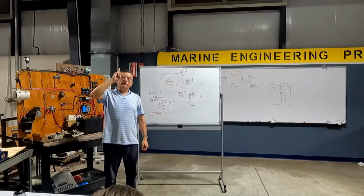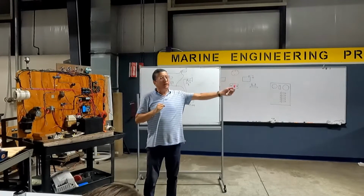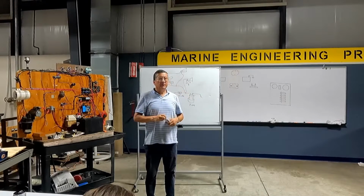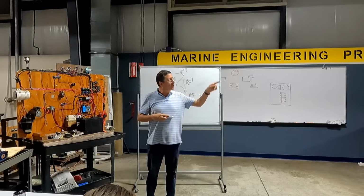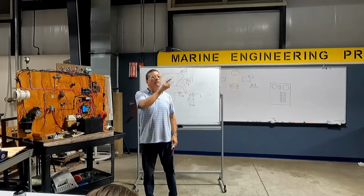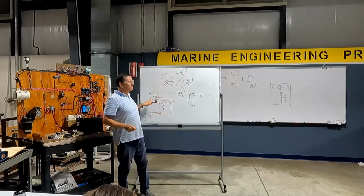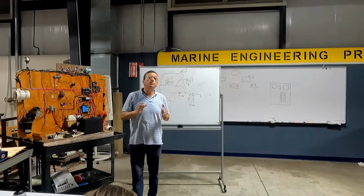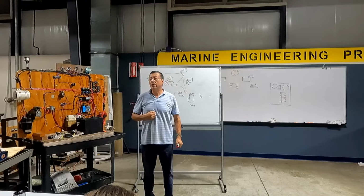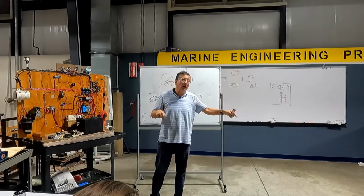All right, I have a question. I say to the technician, Danny Rodriguez, Danny, install 3 bilge pumps in the engine room of that boat. Danny, I want all of those 3 bilge pumps with only one switch. How should the pumps be connected with respect to the switch? Parallel. In parallel. If one pump is broken, the other two are running.